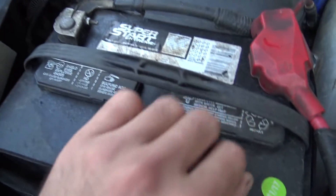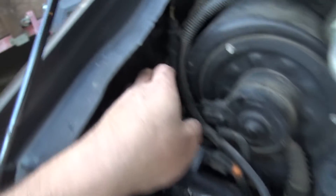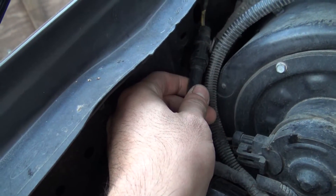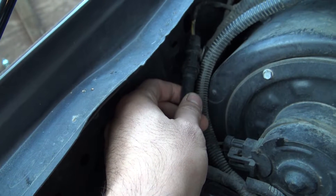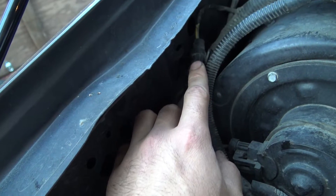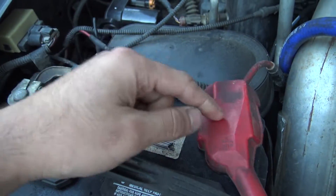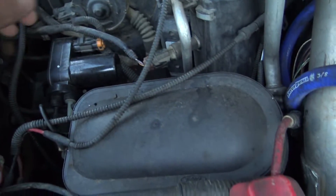We got one of the two batteries, and over in this corner right here is your starter signal wire. So if you want to crank it over by hand — maybe you want to build oil pressure or listen to the compression — you disconnect that and tap it on your positive terminal and that would crank your engine over.